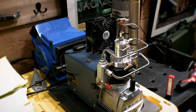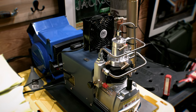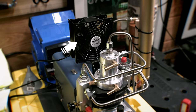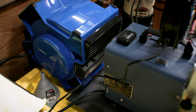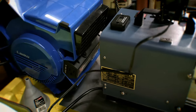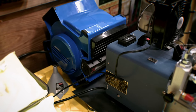One of the most important aspects of caring for your Yongheng has to do with heat dissipation. I've decided to use two high-speed fans to help cool the unit as much as possible. This is a computer fan I got off Amazon that helps keep the upper chamber a little bit cooler. But I think the biggest improvement is using a very high-speed blower through the back — I've removed the plastic cover so it's just open back there. I turn that fan on high speed and let it flow through the unit, and it's dropped the temperature pretty considerably.